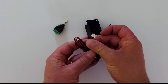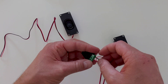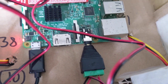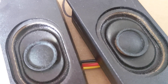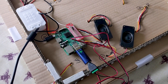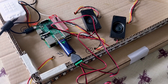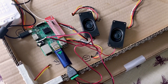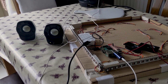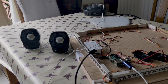I'm hoping to learn more about coordinating lights with sound, so I bought some cheap Adafruit speakers to embed in the cardboard frame. I naively thought I'd just connect them to a 3.5mm jack and plug them into the Raspberry Pi, but the resulting sound was almost inaudible. However, when connected to a USB digital-to-analogue converter, the speakers had slightly more oomph. An AudioQuest Dragonfly USB stick, generously passed on by an audiophile neighbour, turned out to be a premium audio device, as you may hear later when connected to my living room speakers.